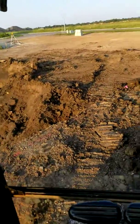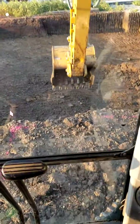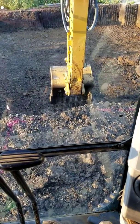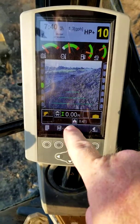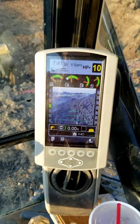The light's fully green. Now you can go back to digging and it's already set in there. We'll go down and touch our teeth to grade. Lower it down — touches on grade. Hear it beep? It's 0.00 feet. That means we're on grade.